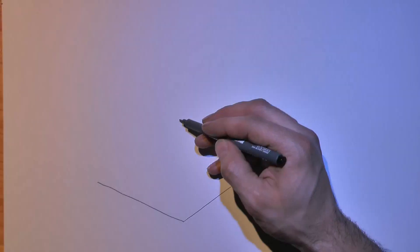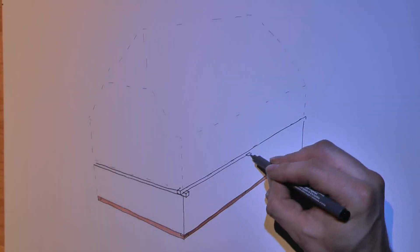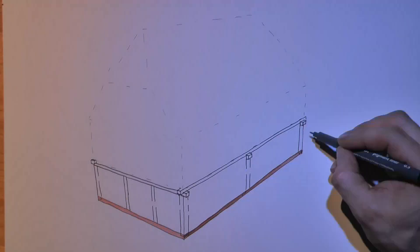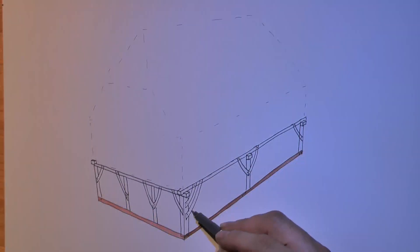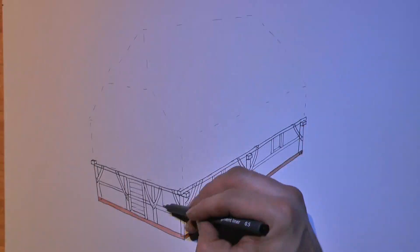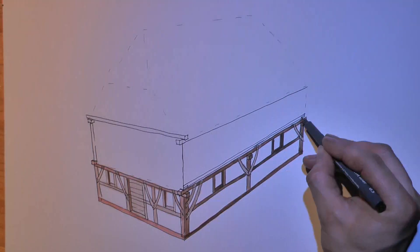In this video I want to show and explain about restoring old timber-framed or half-timbered houses, as you can find them in southern Germany. In the Middle Ages one typically did timber framing by using lap joints for the diagonal parts — braces — which had to keep the rectangular frames stable. This lap joint method is associated with the term Upper German or Alemanic timber frame.